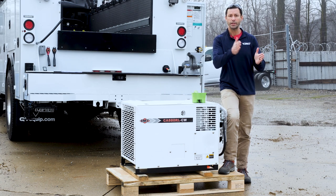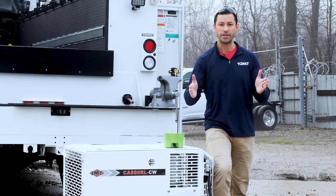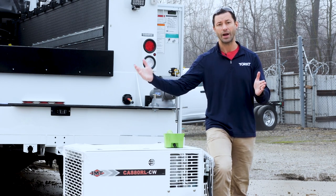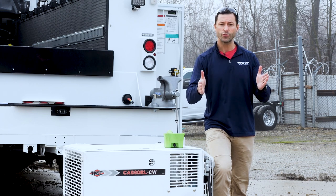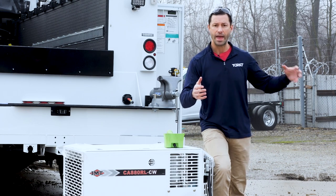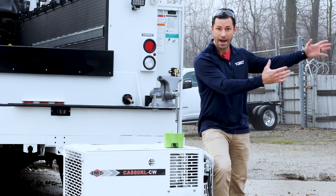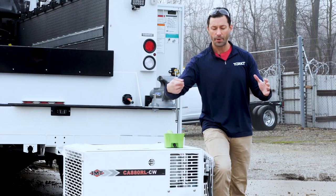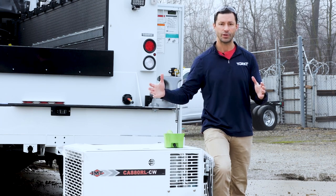Average operating temperature is around 180 degrees on these. You're going to let the compressor come up to temperature, then open your air drain valve and let it run — the manual says about 20 minutes. When your air drain valve is closed, you're not bringing new humid air into the system. Once you open that drain valve, you're moving air through a hot system and the moisture is getting burned off.